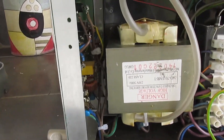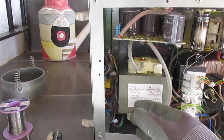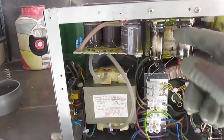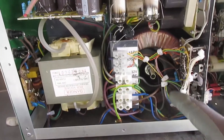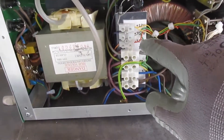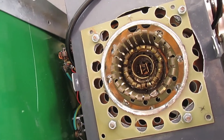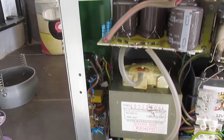This is that self-same transformer installed in the amplifier. Here we've got the HT section — that's going to give me 3000 volts, or maybe 2800, 2700, 2600 under load. Got 350 volts and a couple of SG1Ps, also known as OA2 voltage reference tubes. There's a filament transformer which was for LED lighting. And here we're getting our 350 volts minus 120, because in there is going to go a tetrode — the GU43B. Anyway, let's see if this thing explodes, kills everyone, turns into a black hole, or just works.